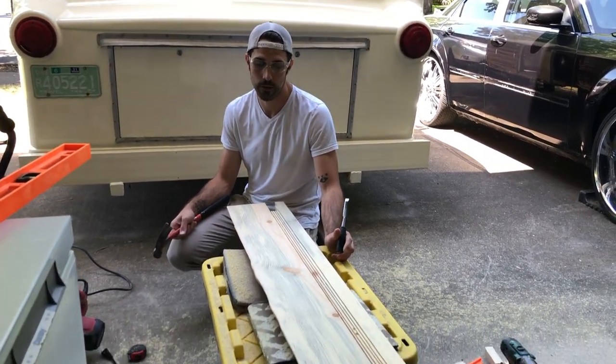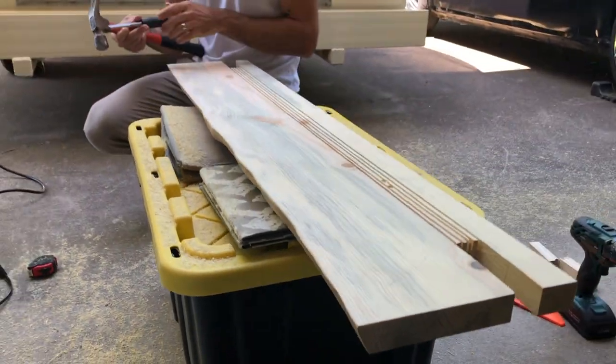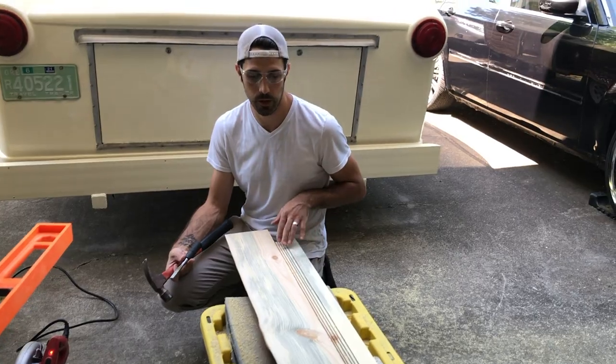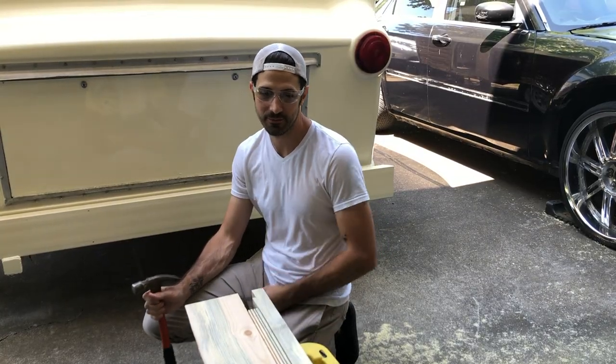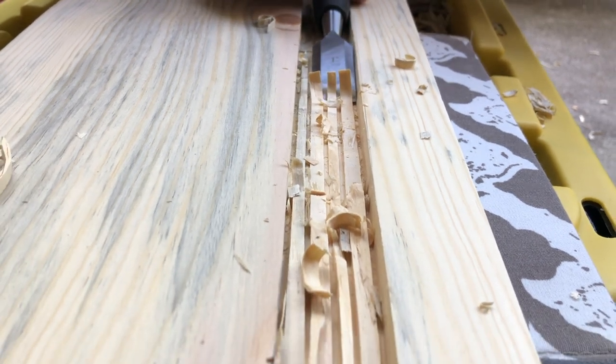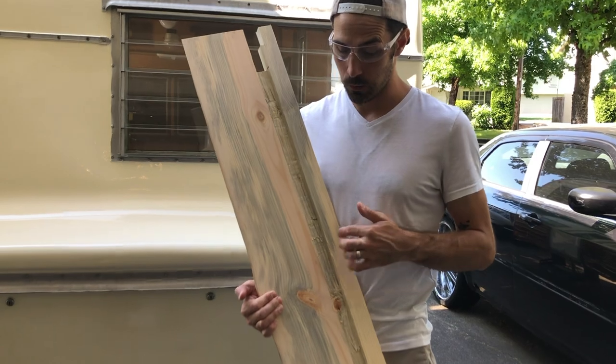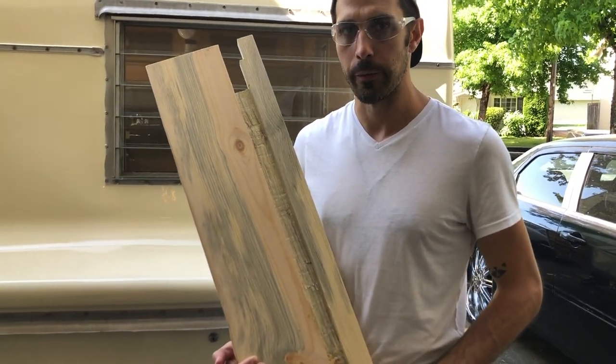This is our live edge shelf that we're putting in — that's going to go in first. What I'm doing here is I'm going to put some relief cuts in here and I'm going to notch this out. I'm just going to chisel all the way down and drop it down about a half inch. Now that it's notched out it should go pretty much perfect into the frame of the window.